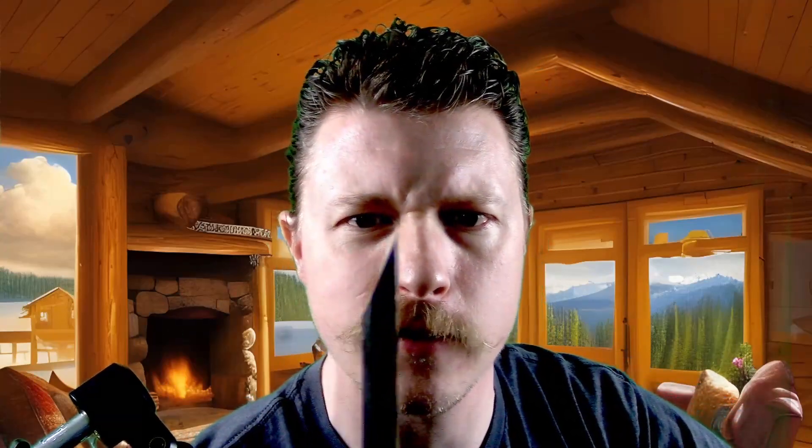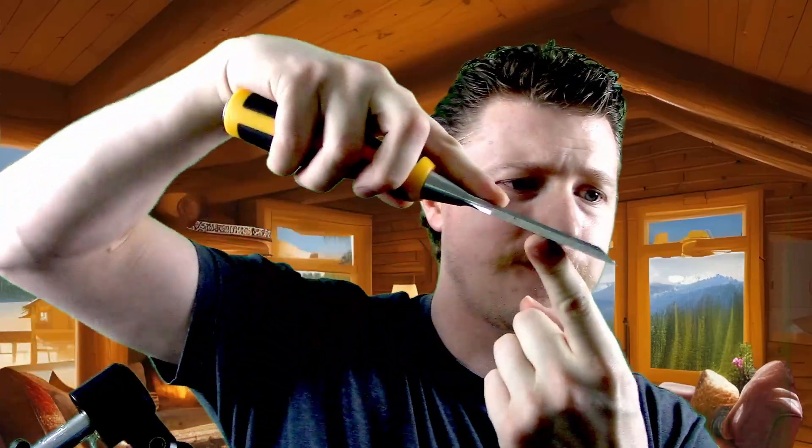Sharpening your chisel-rasp combo thing is going to be a pain in the ass. You can't even sharpen the edge flat. When you're sharpening a chisel, you've got to sharpen this flat edge along with your beveled edge and get the angles right. But if you have a rounded-over half-round rasp on the back of it, it's not really going to fit in your conventional sharpening jigs. And if you have rasp points on the back, you're not going to be able to sharpen the back of your chisel efficiently — you might only get this little edge, and that's not going to give you a sharp chisel you can actually do woodworking with.